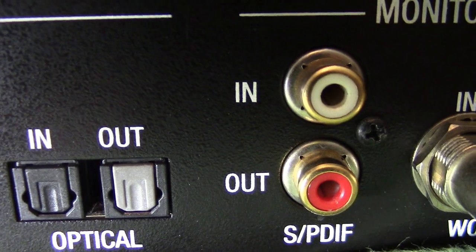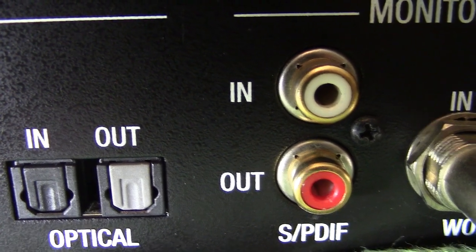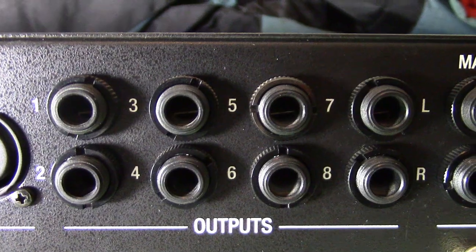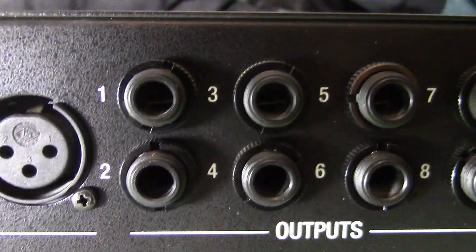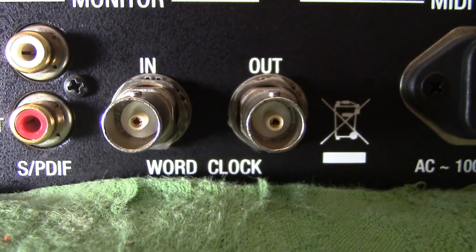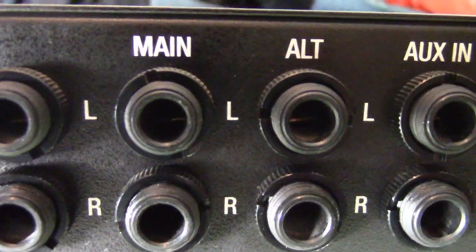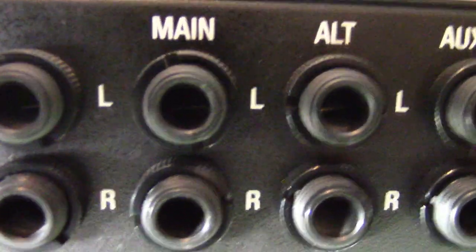The final digital input is a stereo digital input — the S/PDIF, the Sony Philips Digital Interface — which is a coaxial stereo input, and there's also a stereo digital coaxial output. Moving to outputs: there's an ADAT digital out, and there are also eight analog outs that I could use to send to an external effects rack. You'd come out of the analog out into the effects rack, then return back into the line ins — like an effects send and return. There's also a word clock in and out for syncing digital clocks on other equipment, though you don't really need to worry about that in most home studios as it's for pro applications only. And then there's the monitor output — there are actually two of these: one for your main monitors and one for your near-field monitors, called the alt monitor control room.